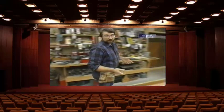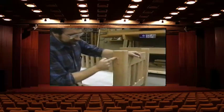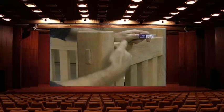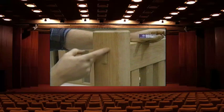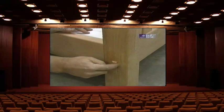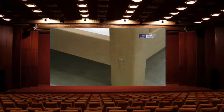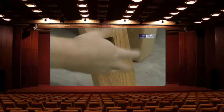I've been working on the final step of the mortising on the posts. The mortises I made for the through tenons are certainly large enough to hold the assembly together, but the problem is the rails are five and a half inches high — the bottom part of the top rail isn't really supported and could twist out of shape. I could have solved it by making a larger mortise, but where there are cross rails coming in, if I had made a large mortise the side tenon could have only been an inch and a half long, and I don't think that's strong enough. So what I've done is enlarged the mortise to give me the support I need to keep those rails from wanting to twist.